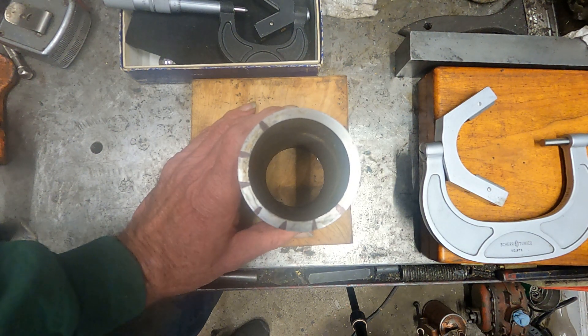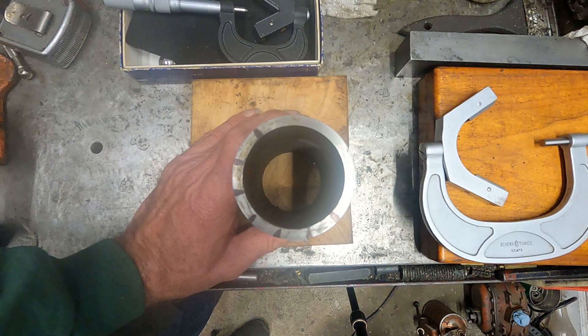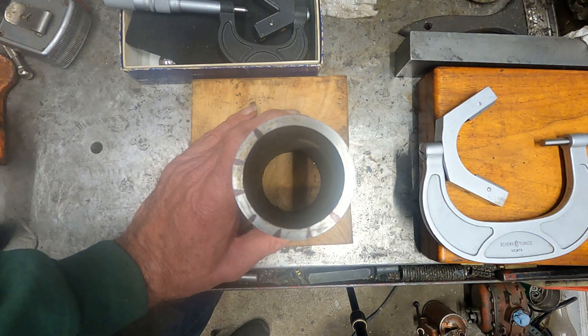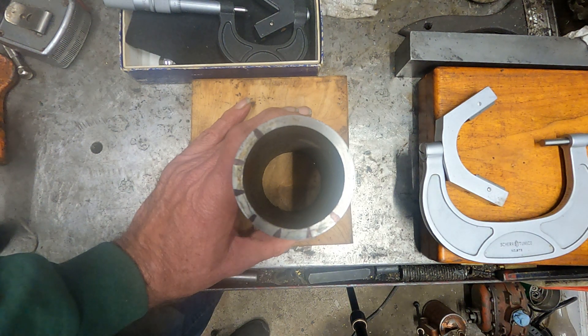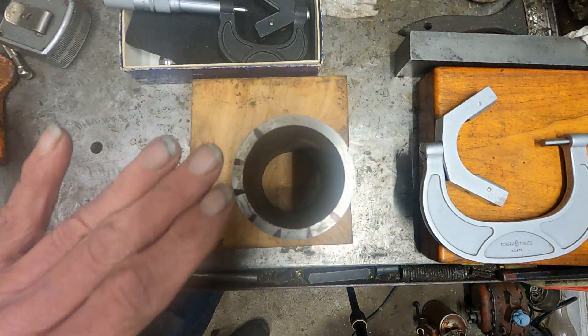That shaft — I'm going to do it right up — the little line boring shafts that are out of round and out of true, that was probably a different problem than what the spindle bearings did. I think that was probably from the tailstock being loose or something, causing that out-of-roundness.